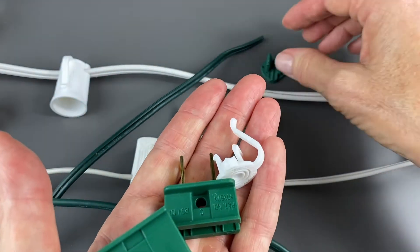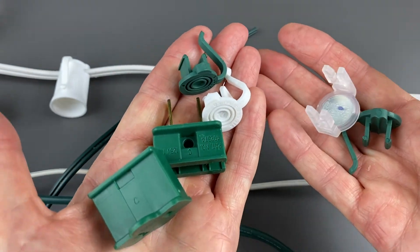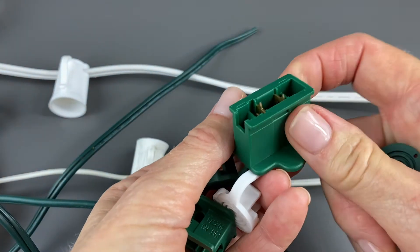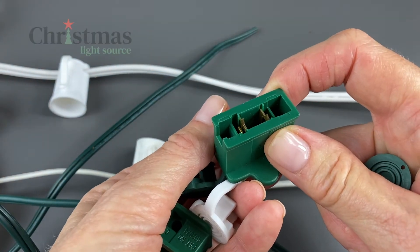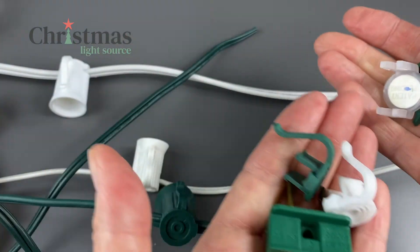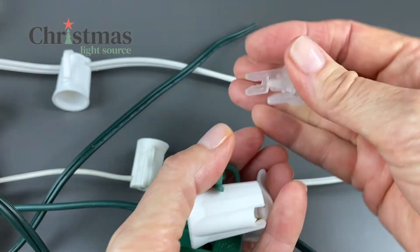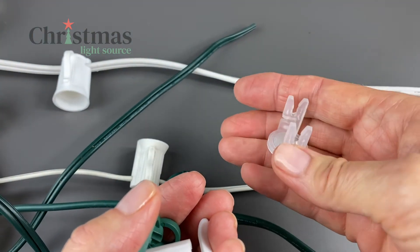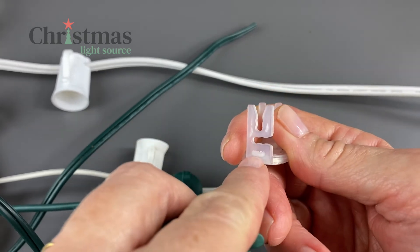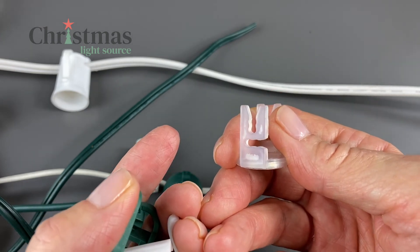Also, be sure that no matter which one you choose — one or two — when you choose accessories like these Gilbert plugs, you can see the channel that's tailored or designed for the thickness of the insulation of the cord that you use, or replacement sockets, or especially our magnetic clips, because these hold the sockets by holding that wire within this little notch. So that has to be properly matched as SPT1 or SPT2 for your cord.